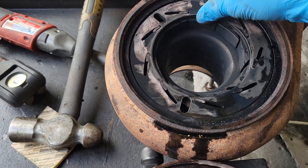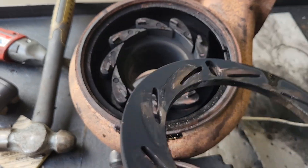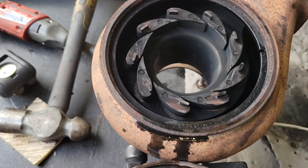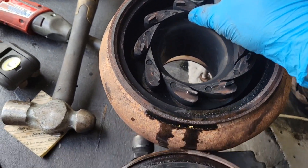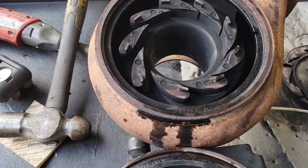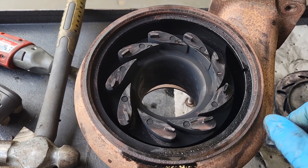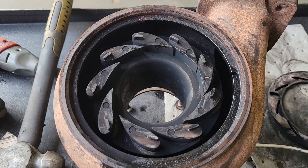Then you can lift your ring off and check it for any wear. Get some Varsol, carb cleaner, whatever you want — give it a toothbrush, wire brush, something — and clean it up. Then check all these vanes; make sure they're all free with no wear. If yours are gummed up or hanging up you're going to have some issues, so give it a good cleaning. Provided you caught it soon enough, you should be able to put it back together and be fully operational.